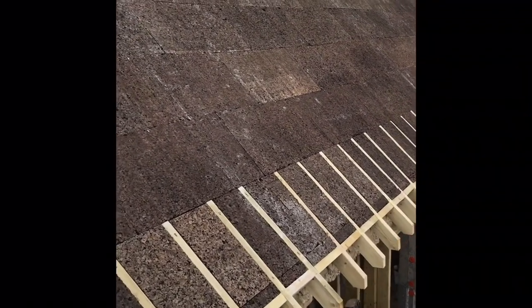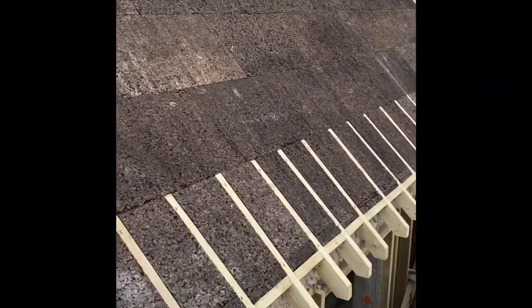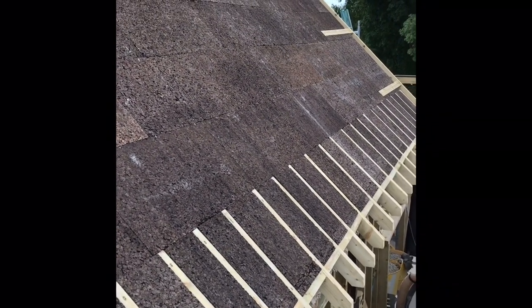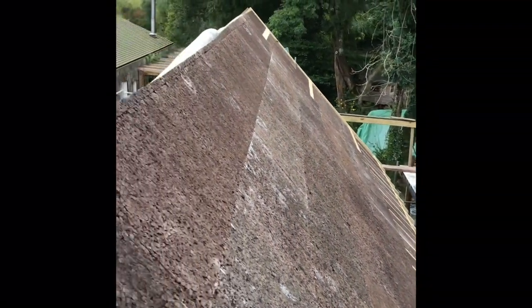Here's the roof all cork boarded. There are two layers of cork board because these aren't tongue and grooved, so to avoid big gaps between boards I've double-layered them and staggered the joints. You can see from here, with the ladder, it retains the old curviness of the old roof. Using 50mm boards makes it more flexible than 100mm boards — it's hard to see on the camera.